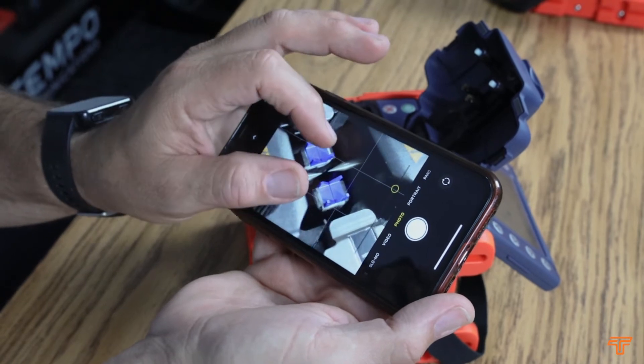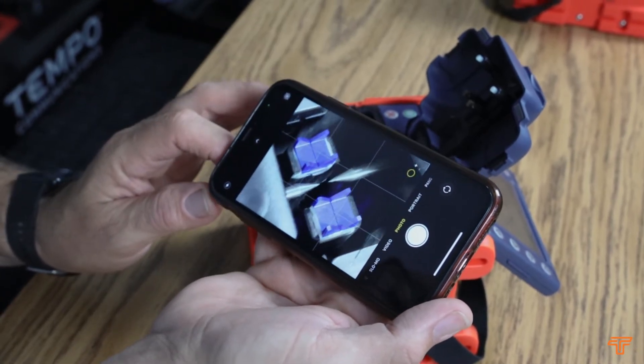This video will show how you can use your cell phone to quickly check if the v-grooves and objective lenses of your fusion splicer are clean. A suitable level of zoom on your cell phone can be used to view contamination. Checking that the fusion splicer is clean will prevent splicing failures and improve your productivity.